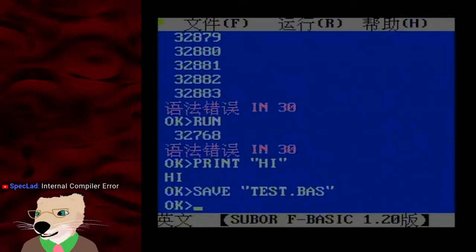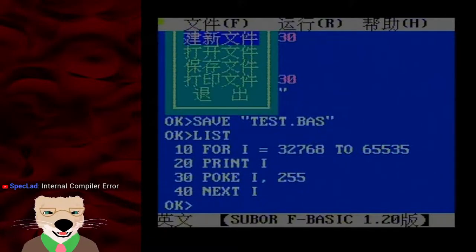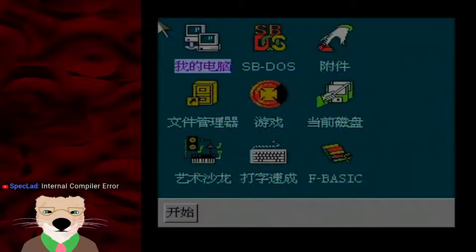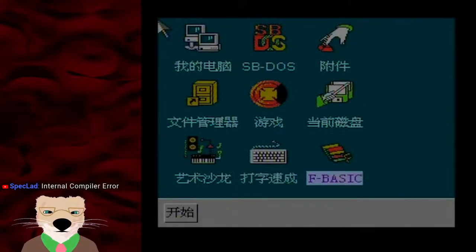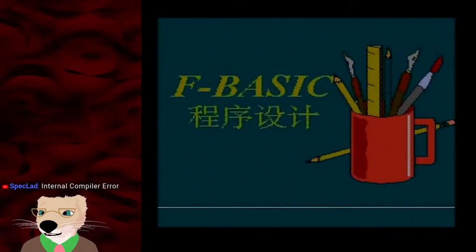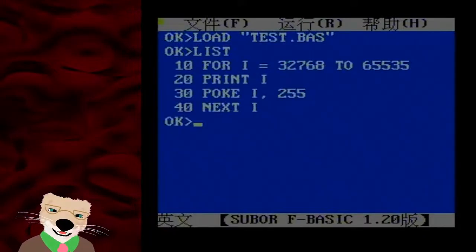I don't know if I'm impressed. I'll only know if I'm impressed once I reload and see if it actually worked. Now, in 6502, the last couple bytes, I think the last six bytes, are the interrupt vector. So if I break those, then it'll fail quite quickly. So instead, okay, now I'm impressed.